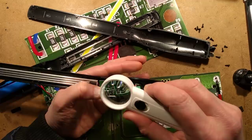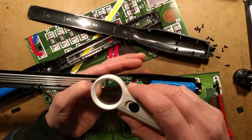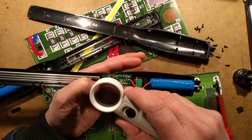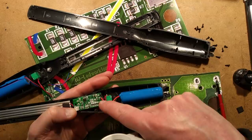I can't quite spot the number on the chip, but I think it's a DW01-style chip that combines the MOSFET onto the chip itself for low-current applications. The other components are more or less the same, but there's another notable difference: this one is missing the input diode and those two parallel resistors. So it's a different manufacturer — they've just stripped out components. This board doesn't even have the manufacturer's name printed on it.